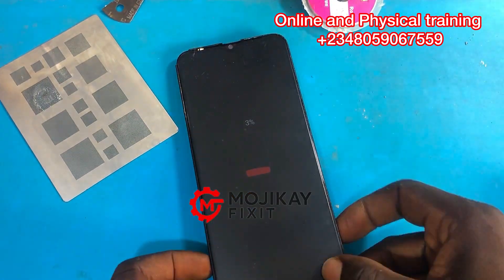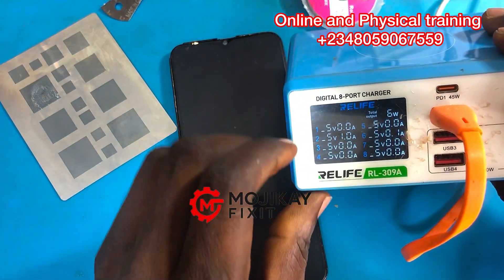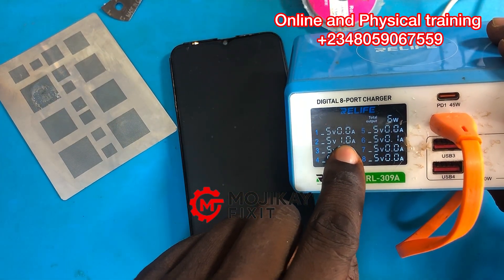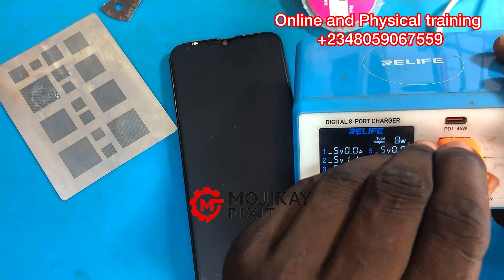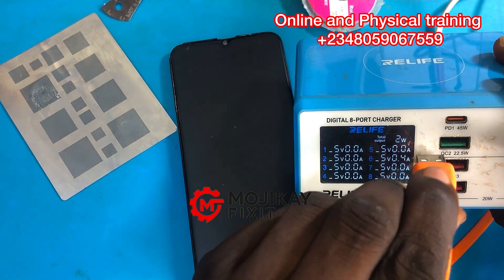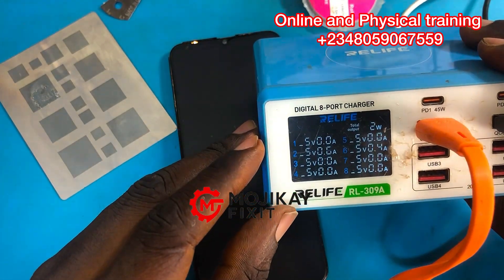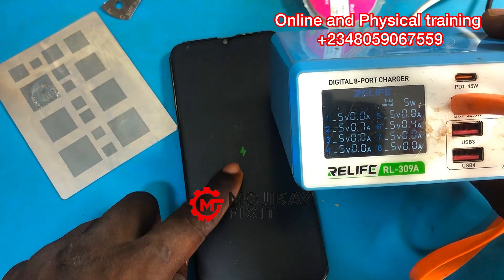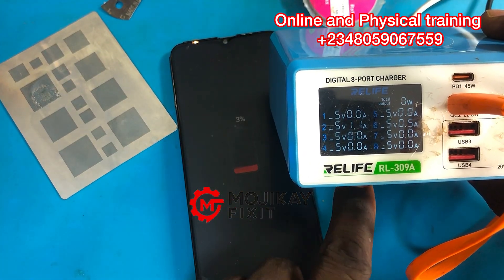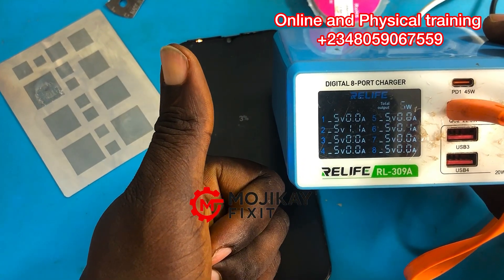Some people might say, why don't you just change the daughterboard? I can also change the daughterboard, but there are some phones where you might not be able to get one. You can see the phone is charging properly — look at the amount of amps showing, which confirms that all the pins are properly secured. It's at 0.7 amps going back up to 1.1 to 1.0. The phone is charging properly. Thank you guys for watching — see you in my next video!